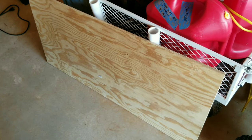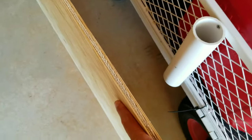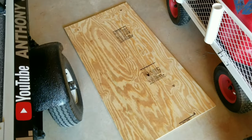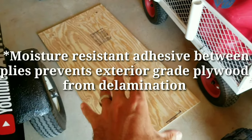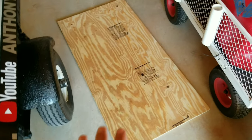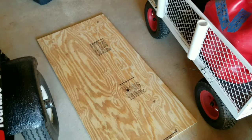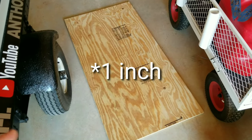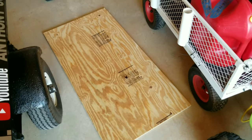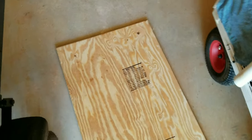Exterior grade plywood is not treated wood. The exterior grade is bonded with a waterproof adhesive, so the veneers can withstand moisture, but the wood itself is not rot-resistant or water-resistant without proper sealing. I'm going to use exterior grade plywood, cut it to the shape of the transom, and double it up so it'll be just under half an inch each — close to one inch total. I'll glue it, screw it, clamp it, then coat it in fiberglass resin, sand it, and finish with oil-based paint.